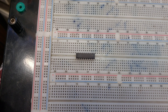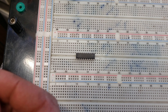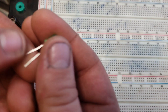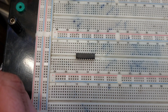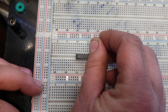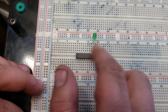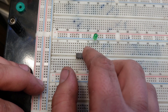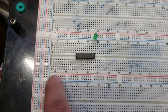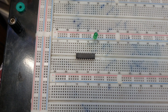All right, so what we will do is go ahead and start throwing some LEDs in first. Start with number 10. Remember, the long lead is going to be the one that we want to go to our power source. So we'll go out from number 10, and I'm going to run it there in the blue, which is usually dedicated for ground. But we're going to run our power on this side, so it's not really going to matter. So now let's just throw some LEDs in.